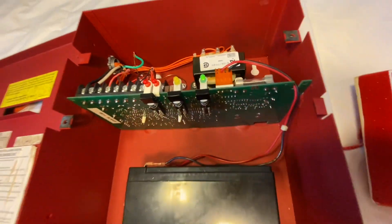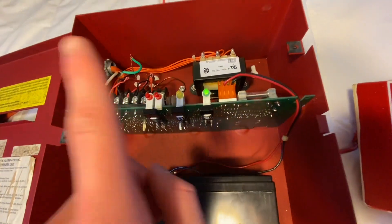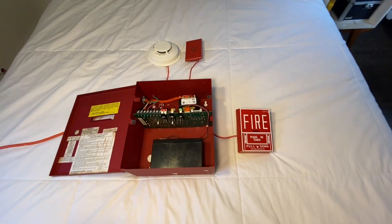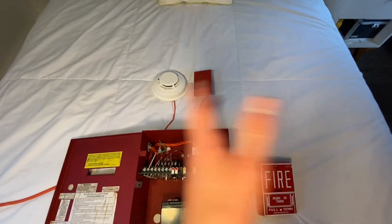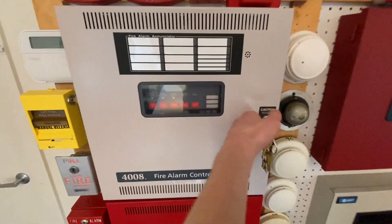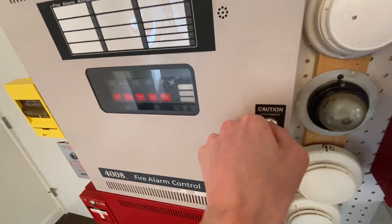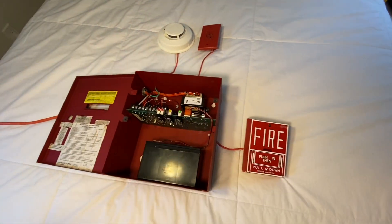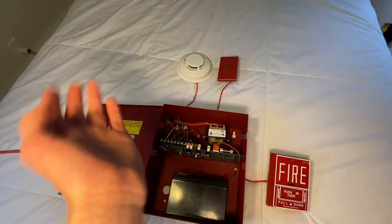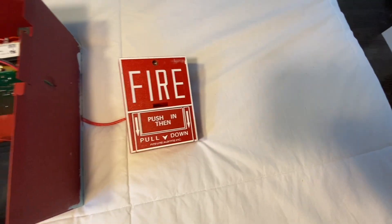Lastly, on the left side, we have the reset button. When it's in alarm, you silence it, then reset the panel, then unsilence. The LEDs right there are zone one and zone two — this is a two-zone panel. In a building, you'd have zone one for one wing and zone two for the other wing. These days we have addressable panels where everything's on a loop and you can tell exactly which device triggered. Back with a zone panel, it just told you the section of the building. I have a smoke detector connected to one zone and a pull station connected to the other.